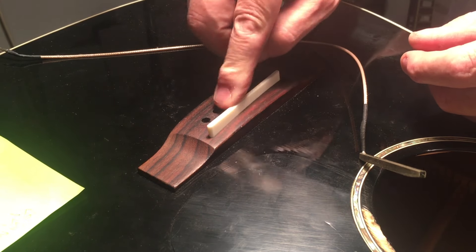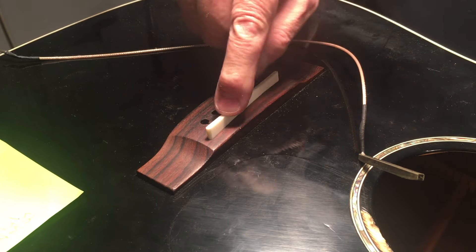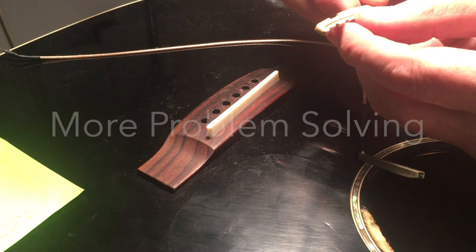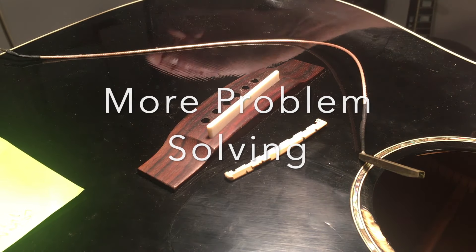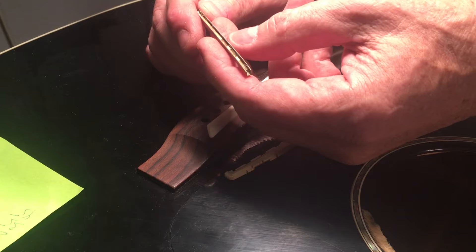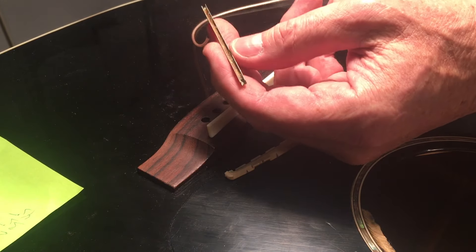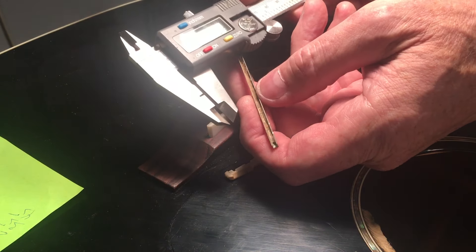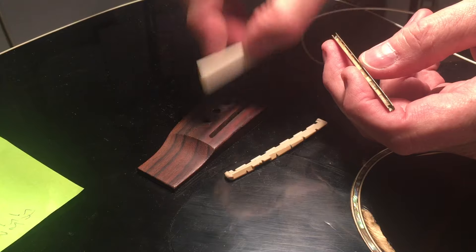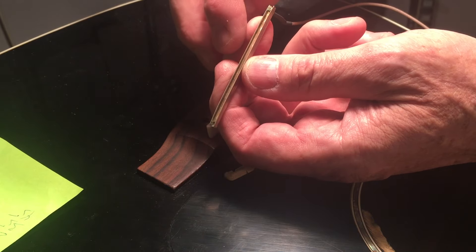The challenge from this point is to turn this bone blank into a functioning saddle. I measured the depth — how much room in the slot the pickup carriage actually takes up — down inside there, and that came out to roughly 80 thou.